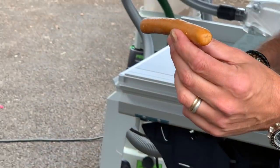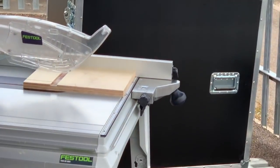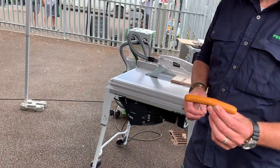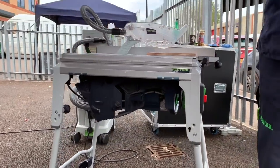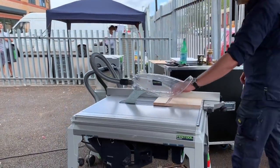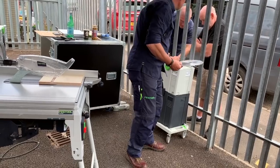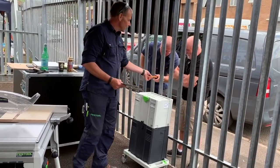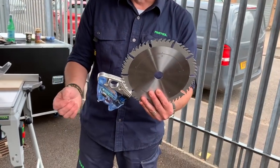On this occasion there's not even a mark on there. Remember: within five milliseconds it takes the blade down and stops it. The tip of the tooth on this blade, at this diameter, is traveling at 60 meters per second — that's a huge distance. There's a lot of energy absorbed by the brake and also to bring the blade down. It's the rim speed which brings the blade below the surface, and it's the brake which does the stopping.